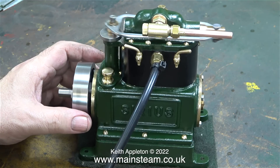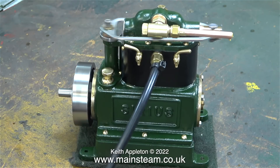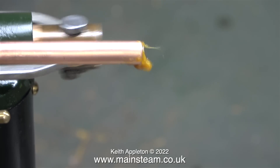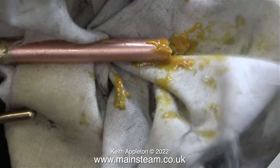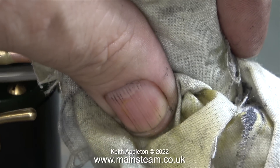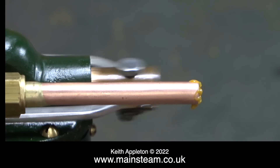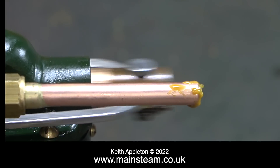The engine seemed to run quite well — it did sound a little bit smoother. Then as I turned up the air pressure it started to do a very strange thing: it blew a massive amount of oil out of the exhaust pipe. I had used steam oil on purpose because I didn't want to fill up the room with oil vapour — this stuff is very sticky and doesn't vaporise very easily. When using steam engines running on compressed air or steam, try not to breathe in the exhaust because it does contain oil. If you are running an engine on the bench, make sure the room is well ventilated. You could wear a mask, or alternatively fasten a large cloth on the end of the exhaust pipe to catch the residue — I do this frequently.